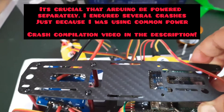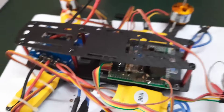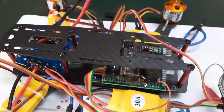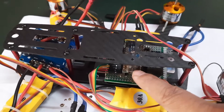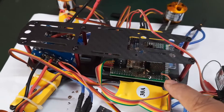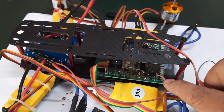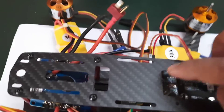A month back I had issues with my drone controller switching off mid-flight and it crashed several times. I found out that because of some power issues, the microcontroller was getting reset and the entire drone stopped functioning. So now I am providing the flight controller and the Nano with a consistent 12V power line going into the V-in pin of the Arduino Nano.